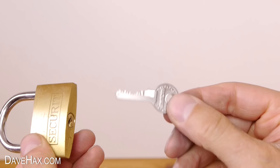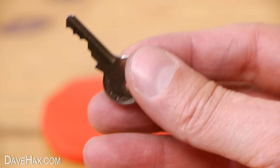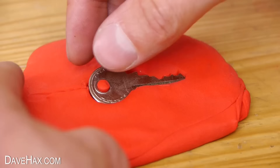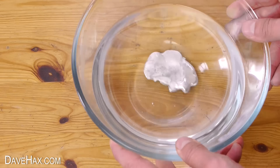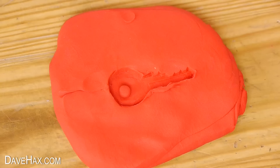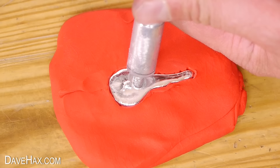I wanted to see if I could use it to make a rough copy of a key. So I took a lump of plasticine and this key from a padlock, which I pushed in to make a rough mould. I was keeping the gallium warm in a bowl of water, so I sucked it up and squirted it into the mould. You can see it doesn't really flow into the corners of the mould because the surface tension is quite high, so I don't think it will work very well — but we'll see what happens.